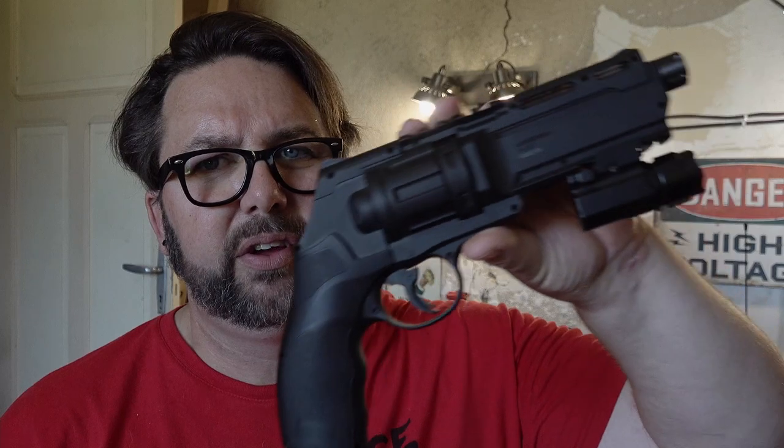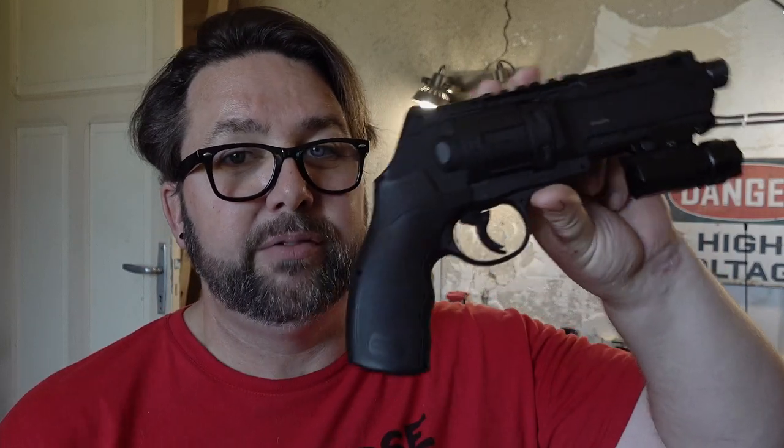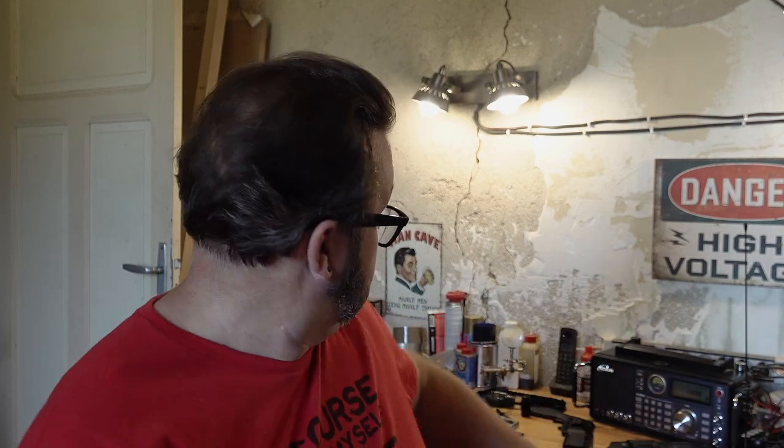This chap got in touch with me - he bought one from a French YouTuber that does a lot with these. This is my one, the 11 joule version, all tuned up. He was having trouble with it, it was jamming on the seventh shot. The first six shots were all right, put another drum in and it was jamming on the seventh one. And when it came to taking the CO2 out it was jammed in there, couldn't get it out. On mine, the CO2 goes in and just falls out.